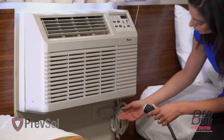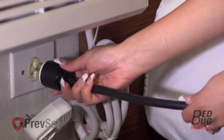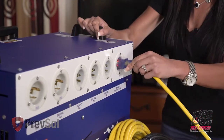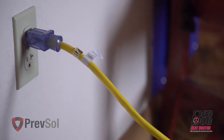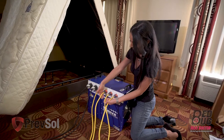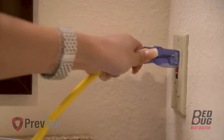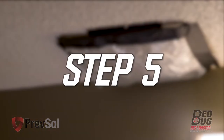In step four, plug one of the 220 cords into the PTAC unit in the room you're treating. The second 220 cord will plug into the room next to you, either to the right or to the left, whichever is available. Take the first yellow cord and plug into the master outlet on the unit, then plug this into a 120 outlet on a single 20-amp breaker. Repeat this with the next three yellow cords, plugging them into the machine and into 120 outlets on separate 20-amp breakers for each cord. You will be using four separate 20-amp breakers for this step.